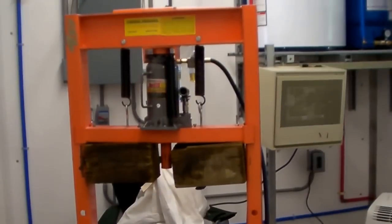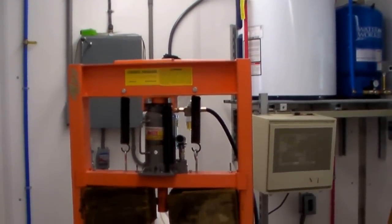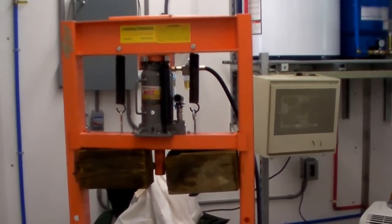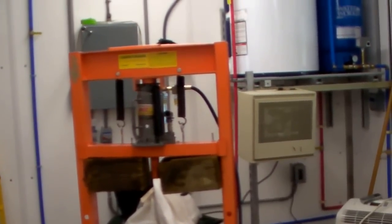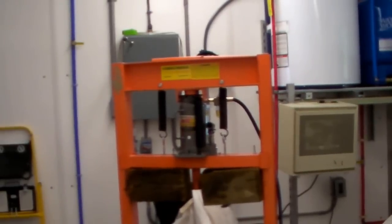What he did is he created a raised platform to raise it so you're not on your hands and knees trying to build a cheese — you're working at waist height, at an ergonomically comfortable height, to use the press. So the next video I shoot about Pimp Your Press, I will show you how I did it. They've used different materials to build their press stands. I'm going to use my favorite, which is strut, mostly because it's available and I really don't have the time right now to be doing all the cuts and a weld job. Also, strut comes with a very corrosion-resistant coating on it, so I'm not worried about it.